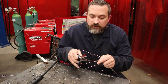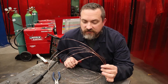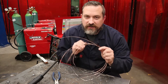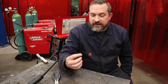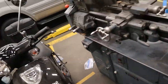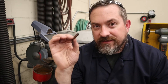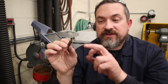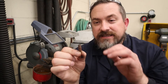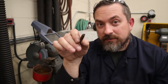Once the wire is out, here's your contact tip. We're going to try to salvage it — just clip off that bit of wire. When I was starting out I always thought what a waste, but realistically we're only looking at pennies, so the scrap wire goes in the scrap bin. Now look at your contact tip: if it's been ground a couple of times and looks haggard, consider putting a brand new one in and make sure the orifice matches the wire diameter you're running.